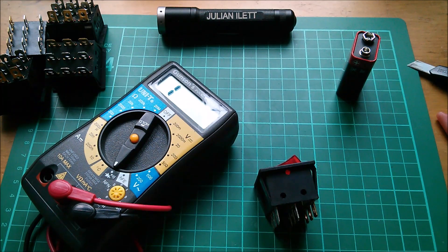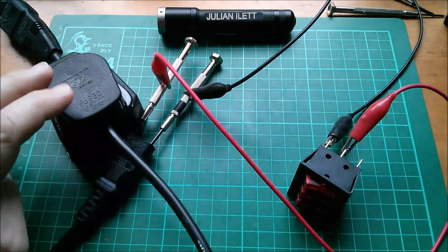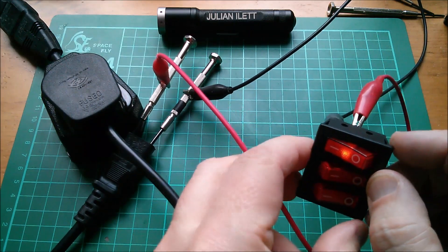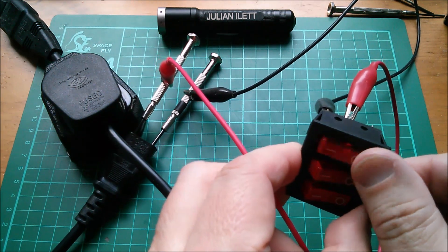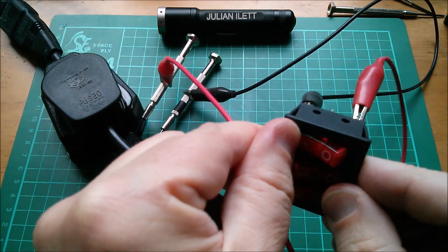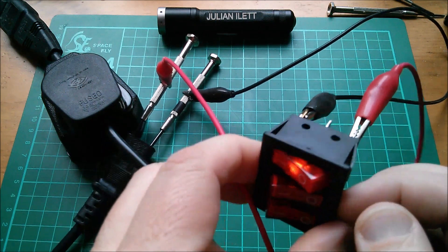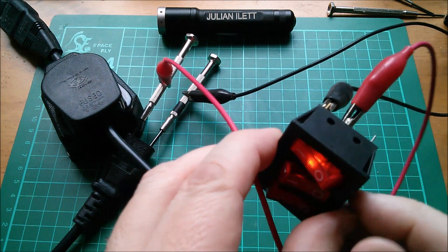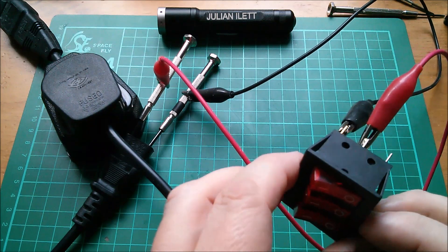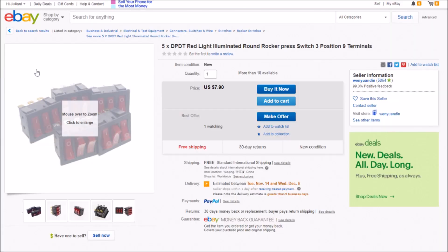That connection is presumably for the neon. I've jury-rigged some mains - this is probably not something you'd want to copy at home. Let's check - yes, that comes on, the neon indicator has lit up. I wonder what happens if I connect it to the other pin - that comes on as well. Doesn't seem to matter whether you connect it to that one or that one - it comes on anyway. So these indicators are mains-voltage neons, not 12 volts, which is a bit of a shame.